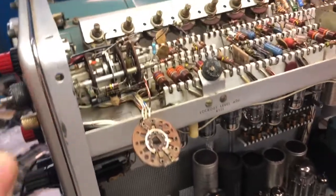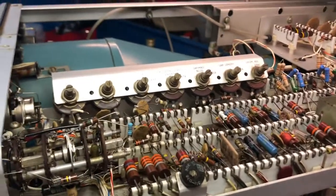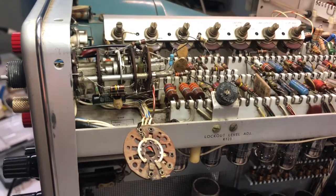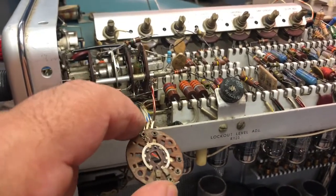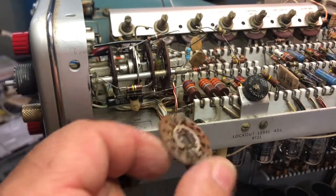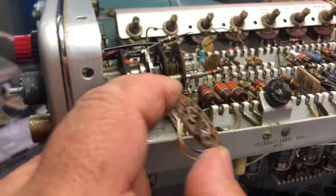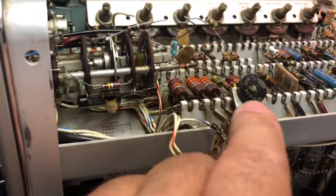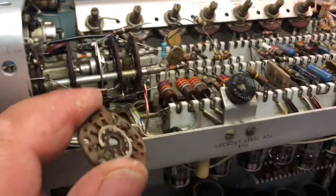While I was trying to repair the trigger section, I started to have a problem with this buffer switch, and indeed it breaks one resistor that is mounted on it. I found that there is continuity between the two layers, front and rear, and there shouldn't be, of course. I'm having around 2.9 kilo ohm, which of course makes a short circuit between the rear and front sections.